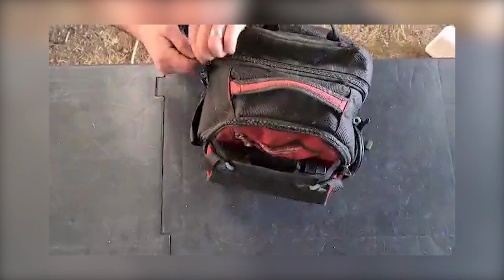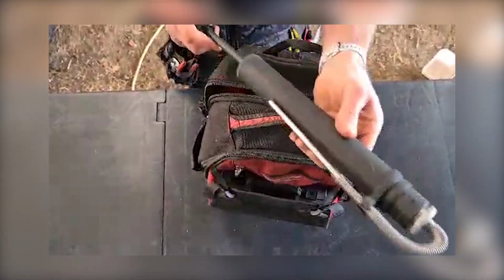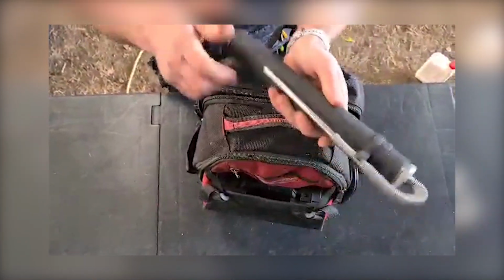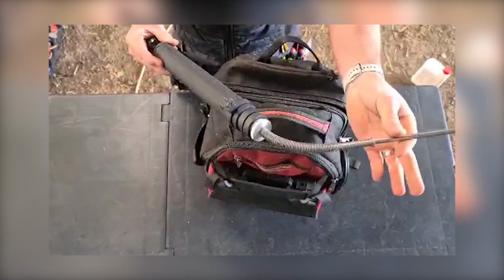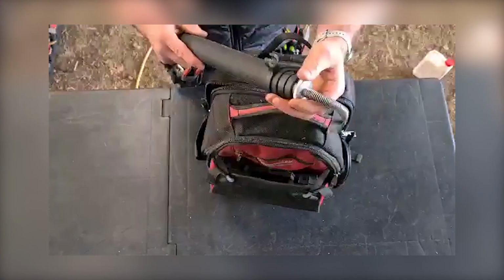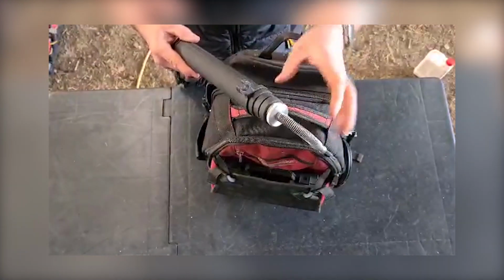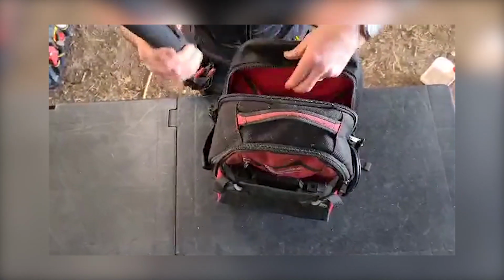Right, we open the back side of the bag, this is where most of the testing occurs. In here, the smoke pump. This gets inserted into the flue. Before we put our Telegan in, we do a smoke test, bit of paper in there, and we're making sure that we're getting a smoke reading of 1 or less. If it's darker, we will not put the Telegan in, because it'll damage our Telegan, an expensive bit of kit, so that just blocks that out.